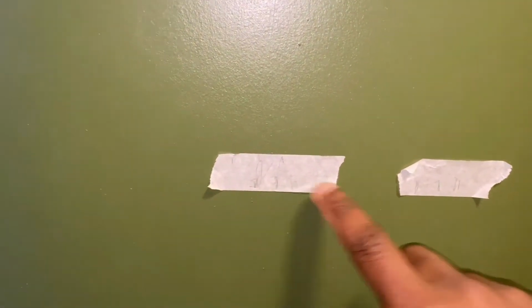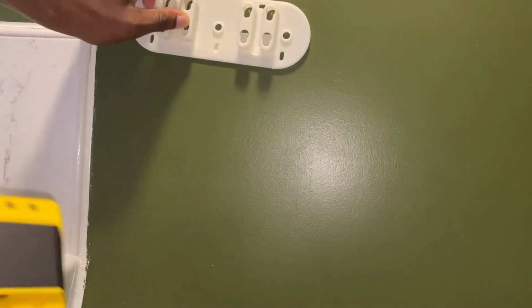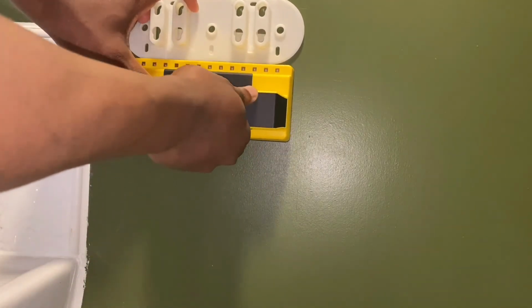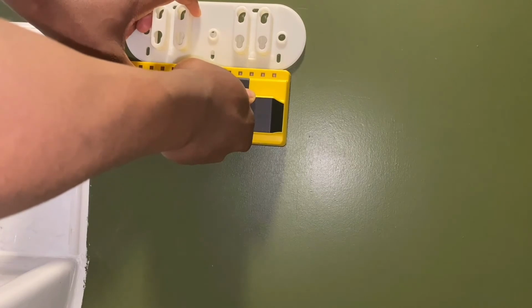Like I said previously, all walls are different, and although, as a general rule of thumb, studs are spaced 16 to 24 inches apart, sometimes you can have three or four studs within the 16 inches when doing bathrooms, high traffic corners, in bathrooms for showers, you know. And just to be sure that you're not hitting a PVC pipe, use a multi pipe and cable detector, metal detector, okay?